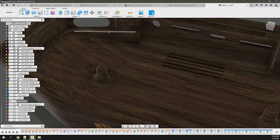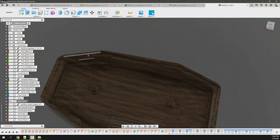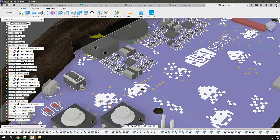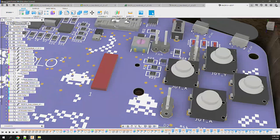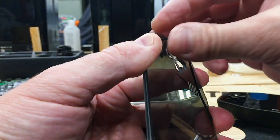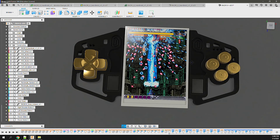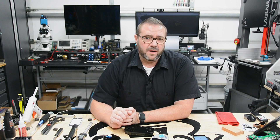Improving the assembly: I added internal tolerances allowing for more variance in parts and assemblies — a blessing for variation in board sizes and support for various materials that shrink and machine a little differently. I incorporated standoffs into the ledges and design to provide proper alignment and stability. I also incorporated an o-ring in the acrylic face to create a compression seal which is easy to install and can be disassembled if needed. Finally, a unified sub-assembly combines and assembles the internal parts of the body for a great fit with the electronics.